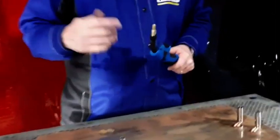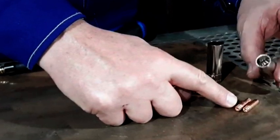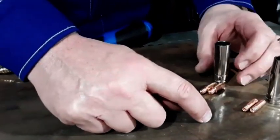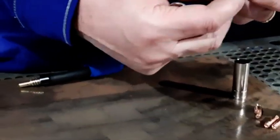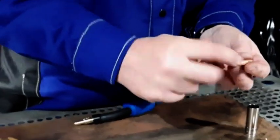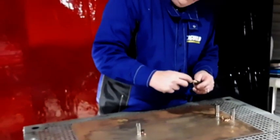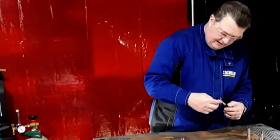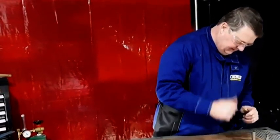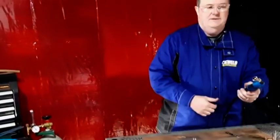So if you're doing a little bit more heavy duty work or really pushing your welding machine to the top end of its capability, then you can move away from the 6mm diameter tips and the smaller nozzle up to a larger diameter opening nozzle, but also a much bigger contact tip body. It's still M6 thread, but it's an 8mm body. That extra 2mm gives it a lot more current carrying capacity, and they last longer. And there is the bigger nozzle.